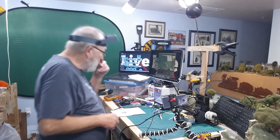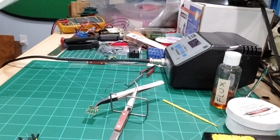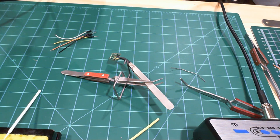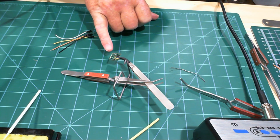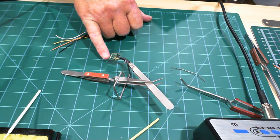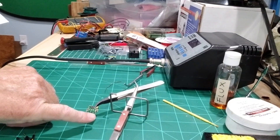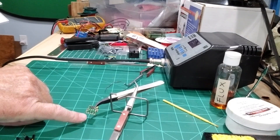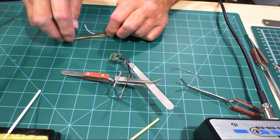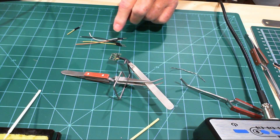We're ready to go. We got three cameras on — this one, that one, and this one over here. I've got four wires tinned; they are 24-gauge stranded wire. We're going to do the four outside ones — two on this side, two on this side. The center one is supposed to be the blue common wire, but since we're not hooking up the decoder right now, we're just testing it. I'm just going to do the four outside ones, which should be violet, green, brown, and white/yellow. Since I don't have those colors I'll just use the ones I have here, cut from my test leads.